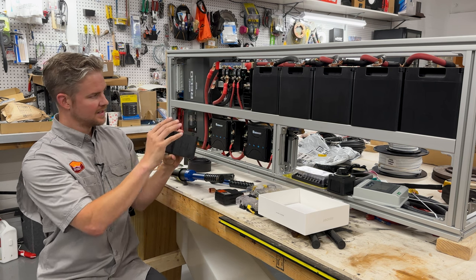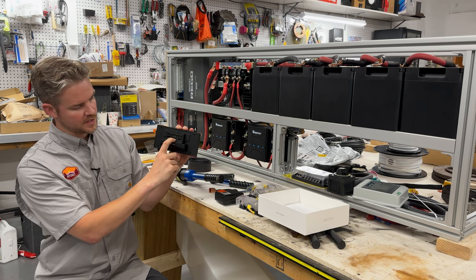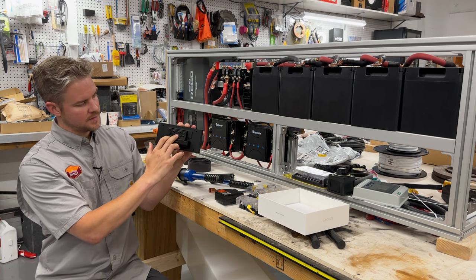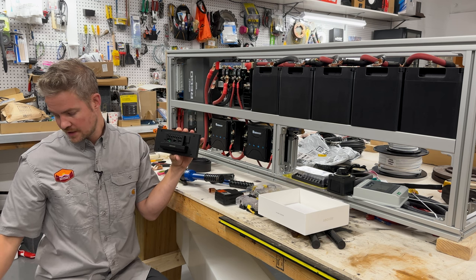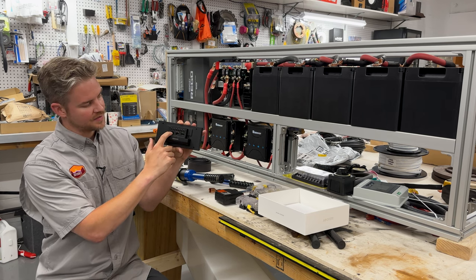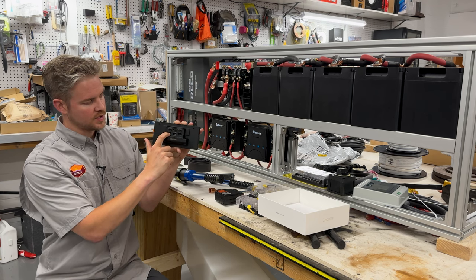So once everything is connected via Bluetooth to this system, now you can do it via Bluetooth, but then it also has the Ethernet port back here in the back. Technically, this is the RS-485 port. So you'll plug this in if you don't want to do the Bluetooth. So you could just plug a cable up directly from the hub to this. Secondly, you have the Type-C and this positive and negative port over here on the left. So if you have a Type-C cable that's already powered, you can plug that in, or if you want to hardwire it right here, you can do that as well.